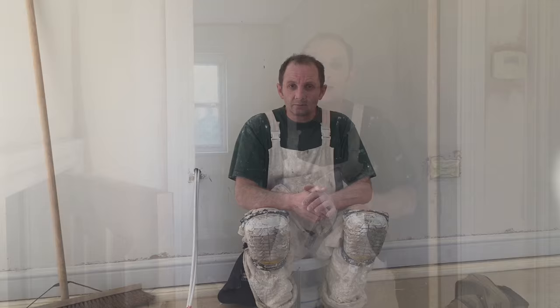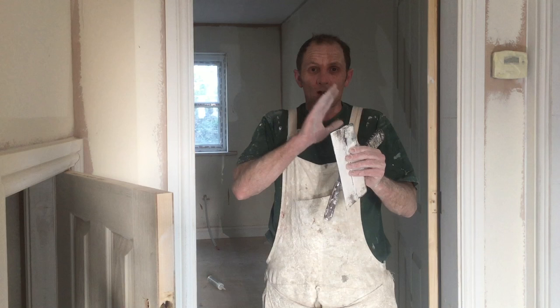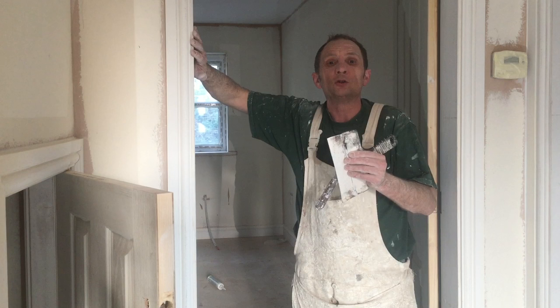tomorrow. And this is a bit of a video on what to do first in your new build property if you're going to spray it out. So I'm just going to go through the procedures of what I'm going to do on day one before I bring my spray gun in on day two. The first thing I'm going to do is get these frames filled up so they're dried off so I can rub them down later on in the day.